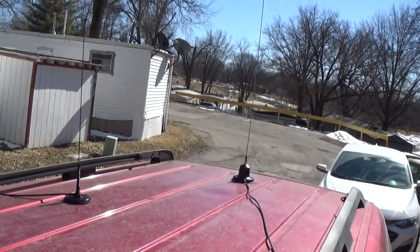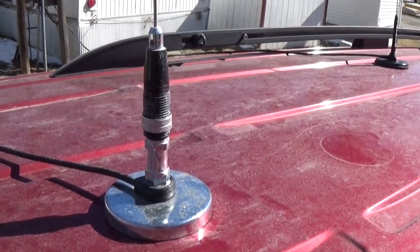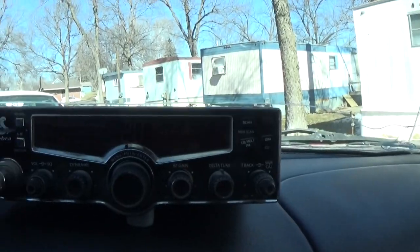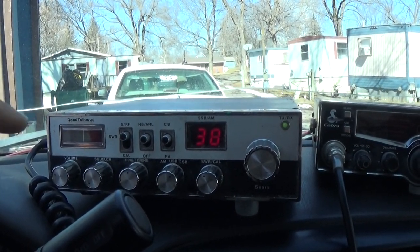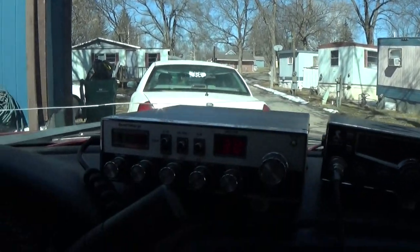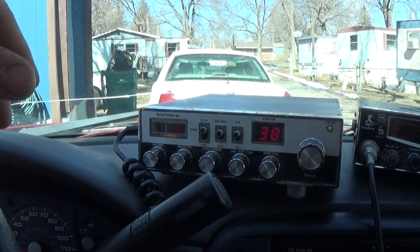Let's go up top and take a look. Here's my three antennas. I got the little whip in the back — just got it — that's hooked up to the side-bander. Then there's this one; it doesn't get out very well but it receives okay, and it does great for local. Both are three-foot. I need to tweak that one a little bit. And then there's the magnet mount for the UV5R. It's sitting about 2.0 to 1 right now, which could be because I'm around a bunch of buildings. If I take it out it'll probably be fine with no tuning necessary, but if I need to there's a set screw — I can just go up or down whichever way it needs.